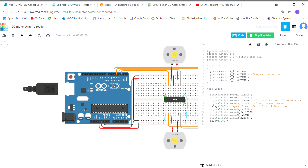I have all my pins defined here, which will allow me to transfer straight up to the Arduino Nano when I'm building the physical circuit. In void setup, I have the pinMode set for motor A's first wire and the second one — so motor A1 and motor A2 — and then the same thing for motor B1 and motor B2. They are all set as outputs using the pinMode function.